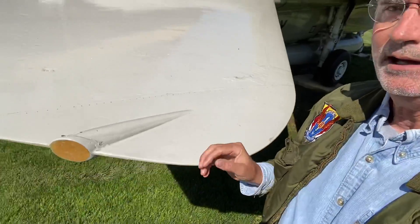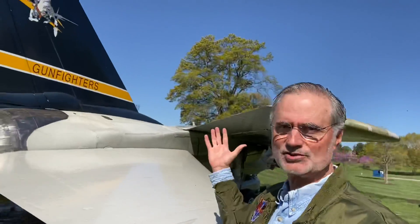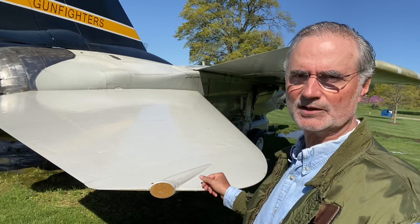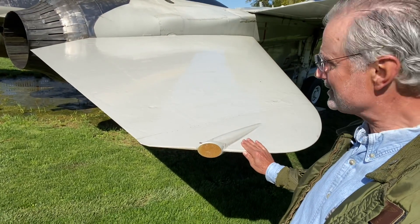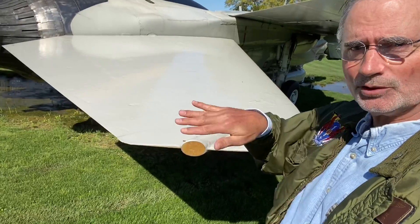We're also making sure there's no leaks and checking our flaps. As I described in the Goose episode, the horizontal stab is gigantic — well, the whole airplane's gigantic for a fighter. That's why we call it the big fighter. 67 feet long, 65 feet wide with the wings spread fully forward in the 20-degree position. But this horizontal stab is as big as an A-4 wing. That's what gives you the good pitch authority when you're dogfighting.